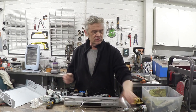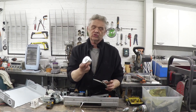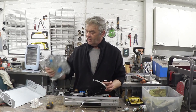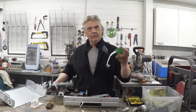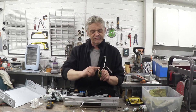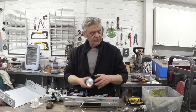What you'll find attached to the carriage return are two things. Underneath you'll find this — looks a bit like a flywheel — and on top you'll find the tape head drum. To remove that, again it's really simple: there are three screws underneath. It'll have a rubber band around it on the central pulley, three screws holding it on. Now this looks like a flywheel but actually it's a brushless motor — really cool because it's got this flat pancake profile. These things have a brushless motor driving these rather pretty aluminium heads.